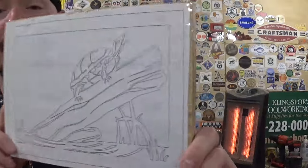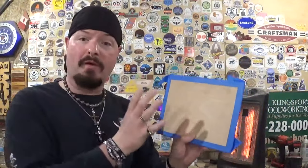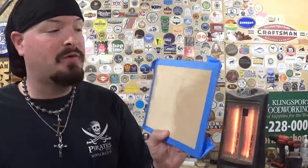The project has amazing little details that will really bring the sea turtle to life. The half-inch plywood is the scroll work piece, and the backer board will be quarter-inch plywood. I've already masked off the borders with painter's tape and we're going to spray paint it blue before drilling pilot holes and scroll sawing. Masking off the backer board ensures the blue paint won't bleed out into the natural wood edge, giving the illusion of one uniform piece when finished.